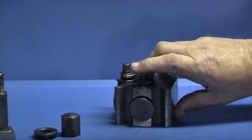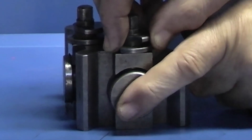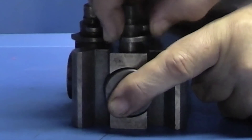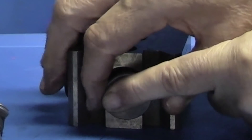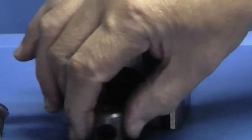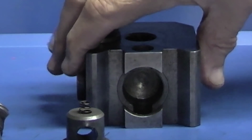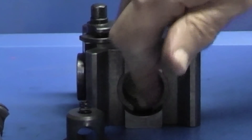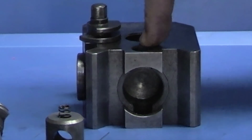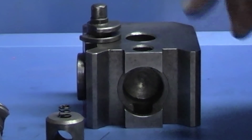So we start with this one on the front — they're both the same. Whichever one you undo, all you do is hold the front in, because it's spring loaded, lift the cam out, and let the button go. You can see that's just an inside — you should have a spring which goes in the hole in the back. What happens is this gets full of swarf and starts to prevent the cam lock locking the tool into the post. So at least once a year I'll take it apart, clean it all out, put some oil on and reassemble it.